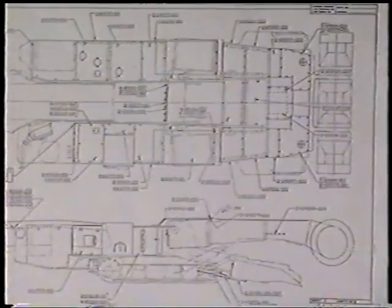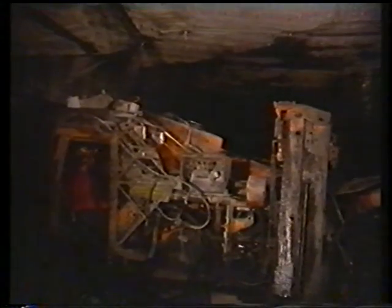We've been concentrating on converting pictorial, or three-dimensional views, into orthogonal, which are useful for accurate dimensioning and true perspective. Orthogonal drawings are used to construct a workpiece. But sometimes they're not the easiest way to visualise the object, like this for example. But if you've seen the object, then the orthogonal drawings are much easier to interpret.